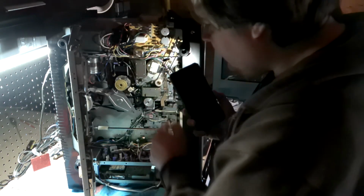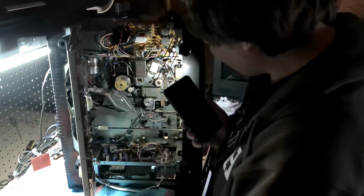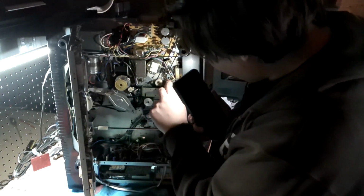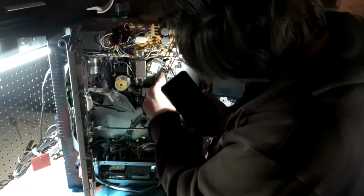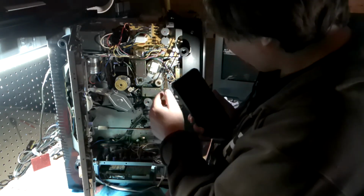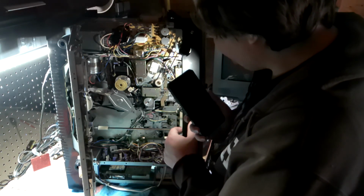This here, you can't really see. There's a little wheel there with stripes on it, and that's where the actual spools turn. There's a little sensor there that detects the frequency at which the stripes reflect back light. That's how it determines if there are any issues with the tape stock, like if it's exerting too much to get the tape moving.